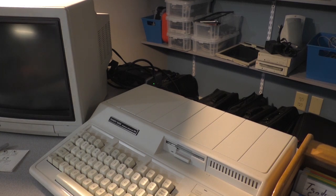And his expansion module consists of 640 kilobytes of RAM, 96 kilobytes of upper memory for DOS and drivers, a 9-pin RS-232 serial port, an XTCF Lite interface for storing software, and unfortunately he has ended production of these boards, but he still sells the empty PCBs and the parts to assemble one, plus the Mouser parts list that you have to order from, and you can basically hand solder and make your own expansion board. So fortunately, those are still available.